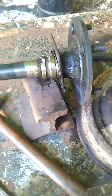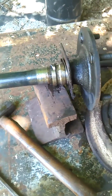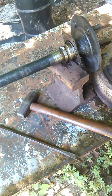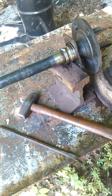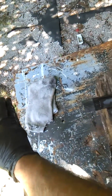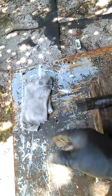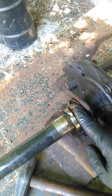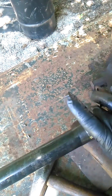I was talking to my uncle to see if he had a hydraulic press to put the bearing back on — unfortunately he doesn't, so I'm going to have to run to town. But he did tell me an old trick: if you're in a bind and don't have access to a press, take two 2x6s — one on each side, about a foot long or longer than your shaft. Bolt them every eight inches or so up and down through here and tighten those bolts so they squeeze. Put your bearing on first, then put your retainer on, and bolt them on so they squeeze right here.